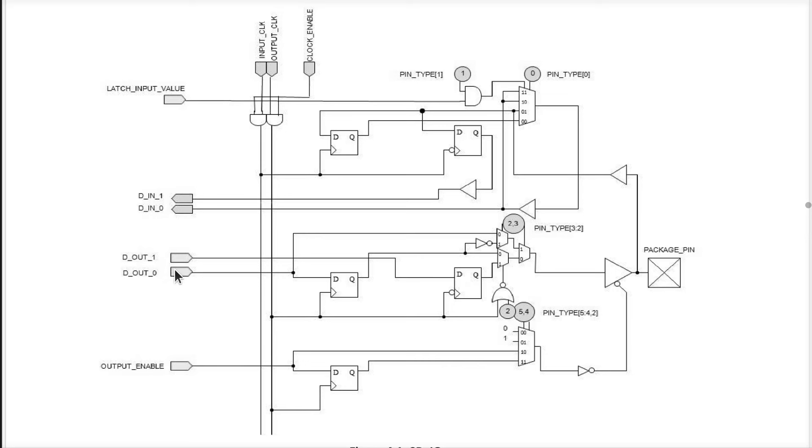You've got a signal on out_zero and if you connect all the magic dots and run it through that MUX, that signal tells you whether you want a one or a zero coming out of the pin. Because this is drawn upside down from the previous view, the input logic is up here. If you turn on that input in this MUX, input_zero can be directly connected to allow you to peek at what's on the pin regardless of whether you're driving it or someone else is. What's missing in this diagram is the pull-up resistor — they decided not to show it in this particular diagram.